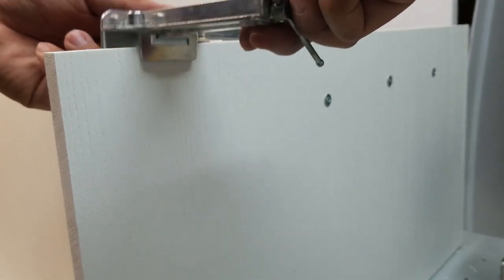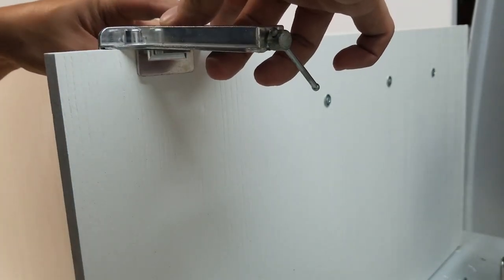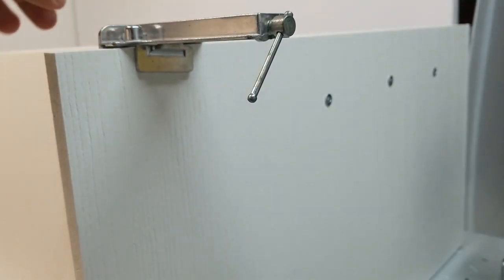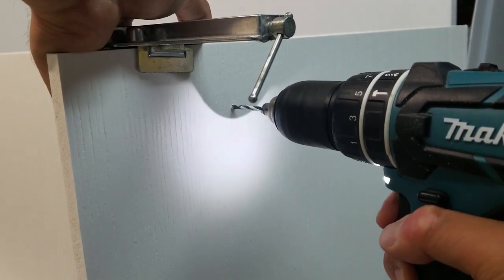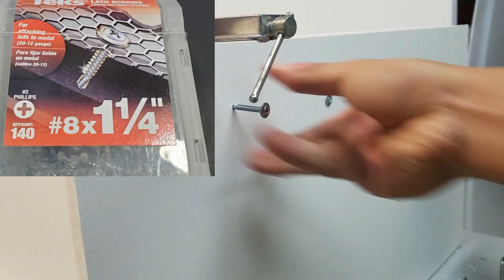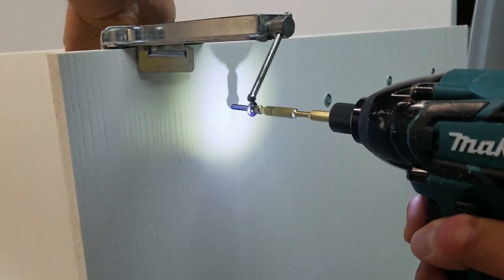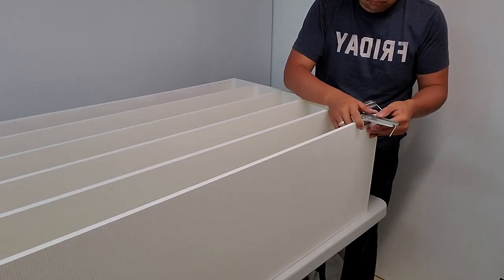Here's a different angle as I install the last interior piece — still using the corner clamps. You can see these screws protrude from the material rather than sitting flush. The screws have a rounded head because the side panel doesn't butt up against any other material, so protruding heads are fine here. Notice I only have one screw holding the panel — later I'll stand the entire unit on its side to put in the second set of screws.